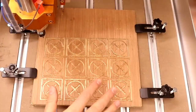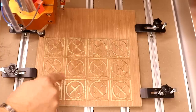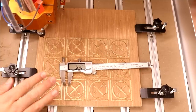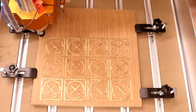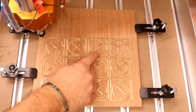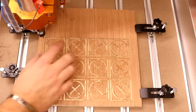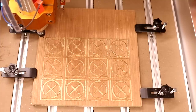My nerves held out and we cut the entire grid. The great news is it cut the last square — six and a half millimeters deep at a thousand millimeters per minute. It actually came out at 6.7 millimeters deep, which either means there's a slight taper in the spoil board or the steps on the Z axis need calibrating. The other good thing about this test is it would have highlighted if any steps were missed — as we were going to the deeper squares, there was a little bit of chatter in the spindle, but everything is in alignment. The circles are perfect circles. This test has come out really well and proven how capable this machine actually is.